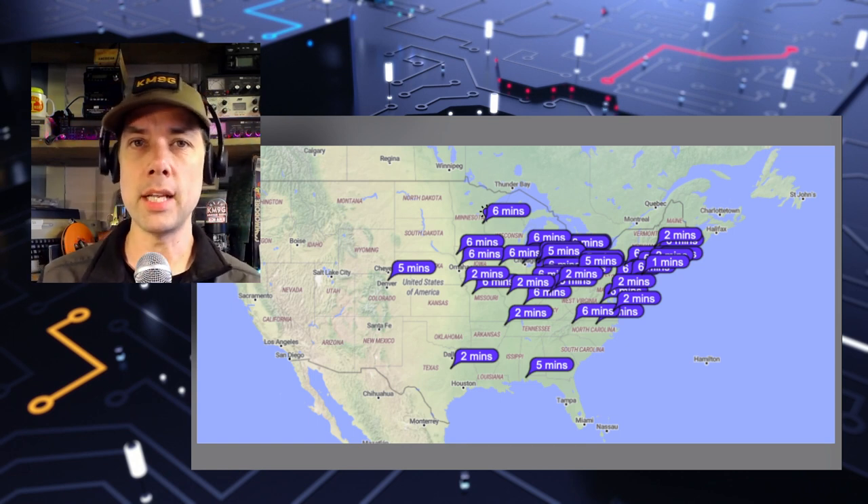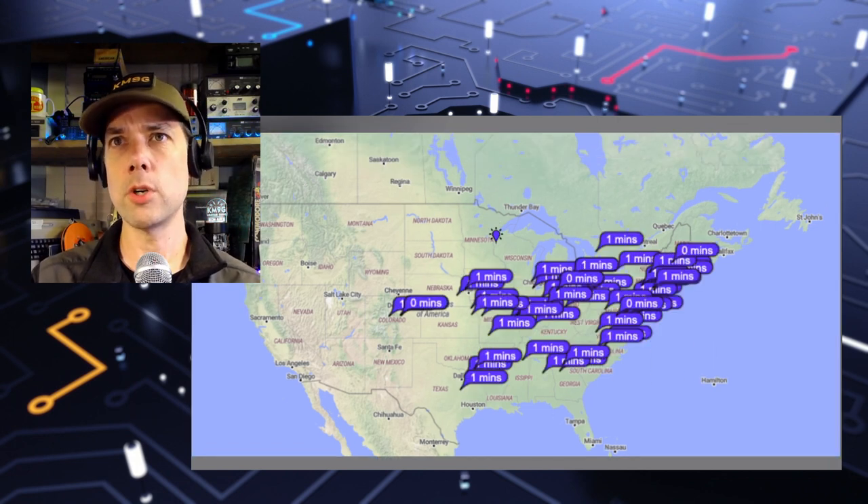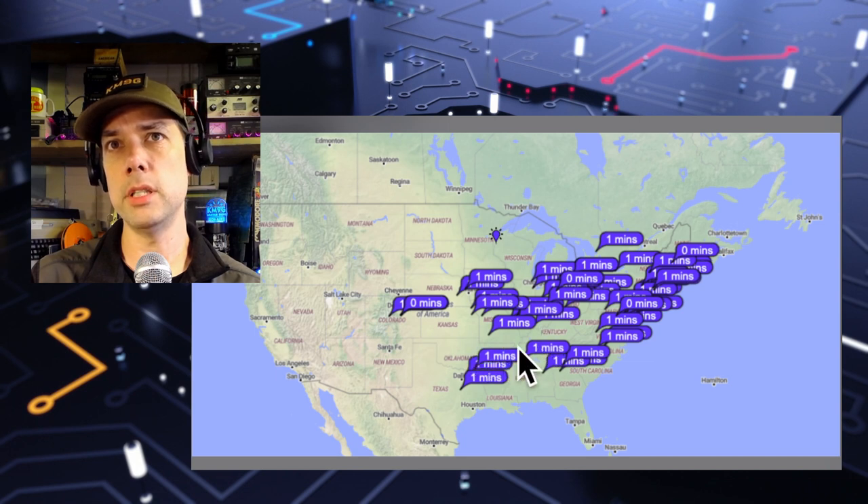Now for comparison, I'm going to use a different antenna — a vertical antenna. This is a quarter wave, not a half wave. This is set up maybe 75 to 100 feet away in the yard with different coax. The receive pattern looks a lot like the inverted V receive pattern, where I'm getting nothing in close and not too far out in terms of receive. The transmit pattern for the vertical on 20 watts — to make a fair comparison to the NFED half-wave on 20 watts — looks a lot like the inverted V configuration on transmit. The vertical's got some more fill-in in that area and a little bit more out to the west than the inverted V does.